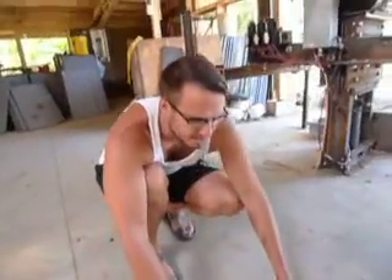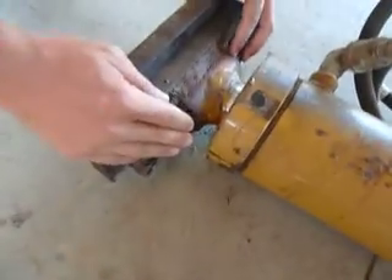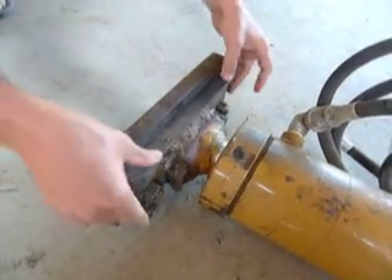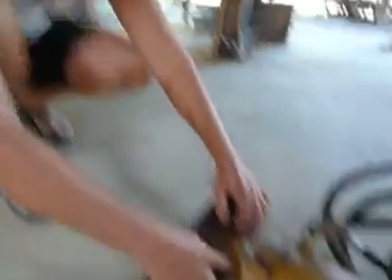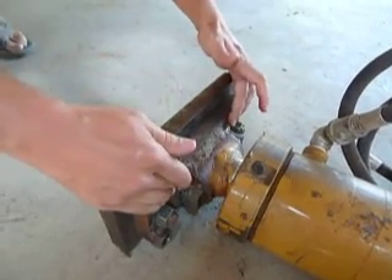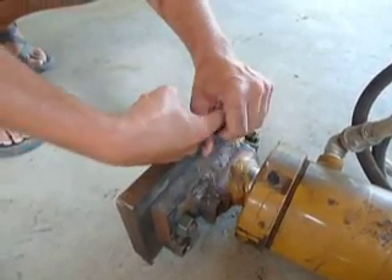The third point for discussion is the cylinder press-foot design. Currently, we cut off the top of the cross-post from the cylinder and weld that onto a backing plate that's then bolted onto the actual press-foot. Instead, we'd like to get a cylinder that gives us a clean edge — a clean top of the post — and then weld a collar onto this backing plate and have a pin that holds the post into the collar. A sketch of that is right here.